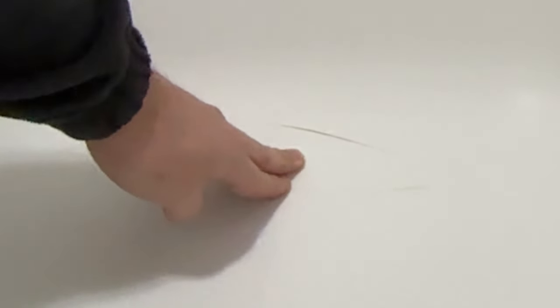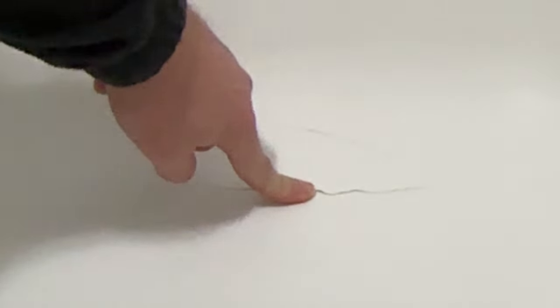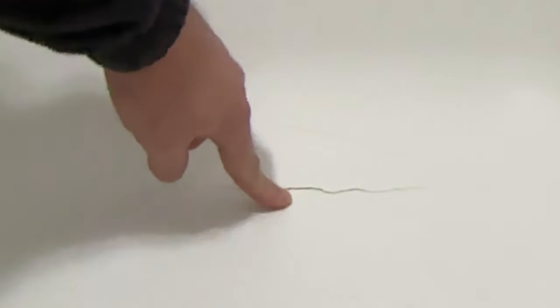All right, guys, here we're back in here. As I compress down on here, I don't know if that's getting bigger or not, but it's right on the edge of all this. And if I press down in here, you can hear it popping. That's where I'm going to put the low expanding foam. So I've got to make some drill relief cuts. I'm going to drill here, up here, and down here, and then inject that foam in first to make sure this doesn't happen again. Because if you're back here again, the cracks are just going to get bigger and bigger and bigger.